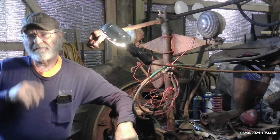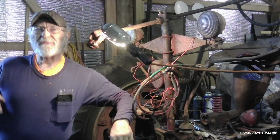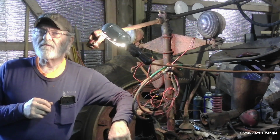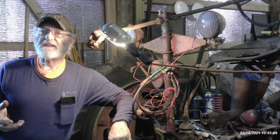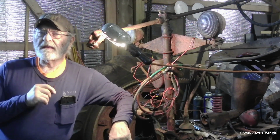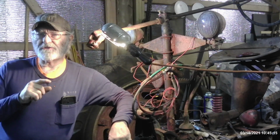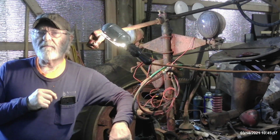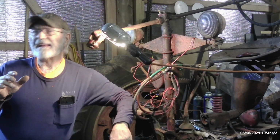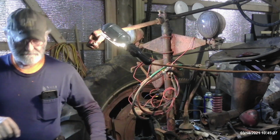Now obviously this is a good place to stop the video on splitting the tractor in half. We now have access to the seals that are leaking, of course, and so the next video is going to be pulling the seals out and trying to get replacement seals, and also the input shaft bearing, because there is a little bit of wobble in that input shaft. I'm assuming the bearing is going to be bad. But at any rate, now's a good time to end the splitting of the 1945 Farmall H to get access to those seals.